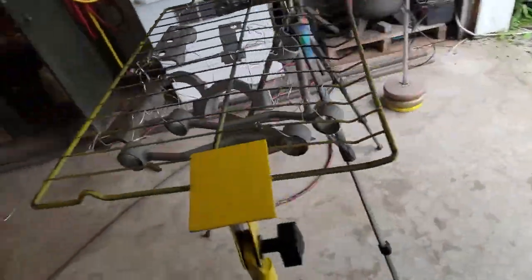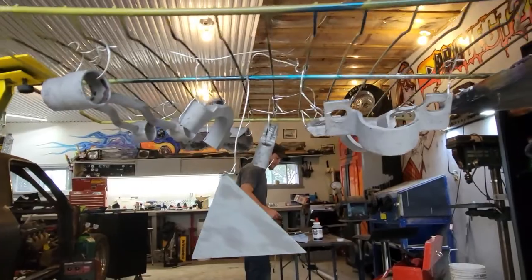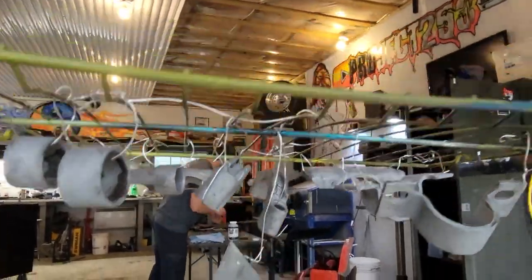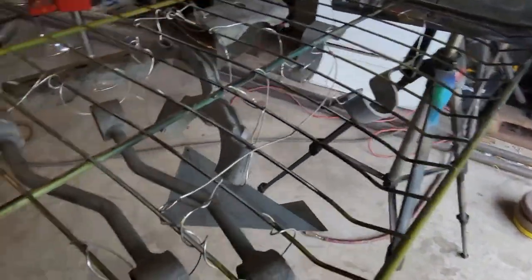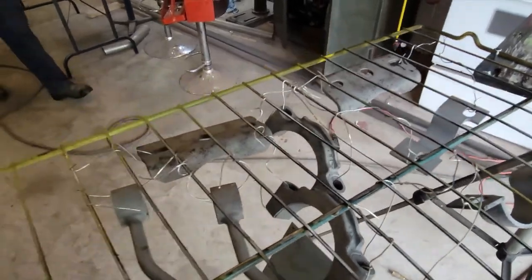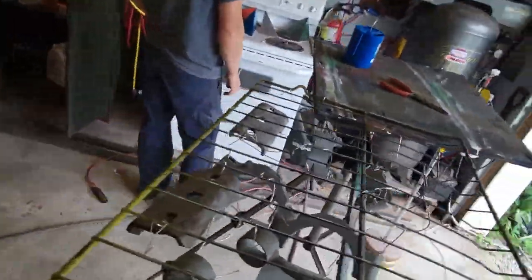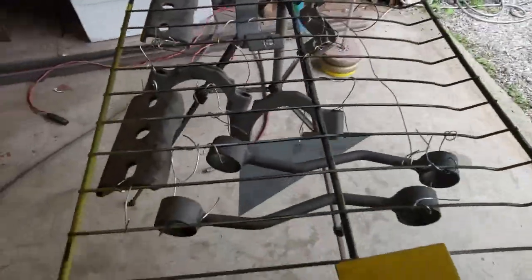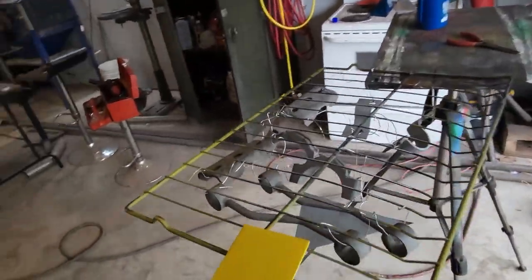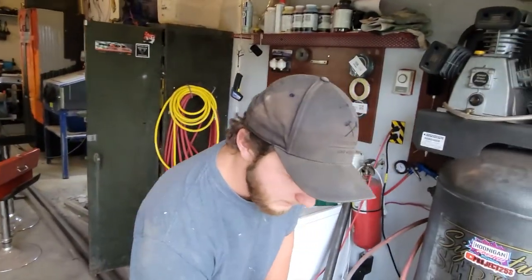This also gives us a chance to test exactly how many parts we can do in one shot. Steve took the time to put all this together — the trick is you've got to get all your wires, that's where the gator clip hooks onto for the positive ground, whatever — that's what gives it the magnetic sticky to make the powder stick on the part. He did this intricate web of stainless steel wire on everything, and we're going to see how it works — hopefully we get good coverage for all these parts in such a condensed area.